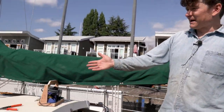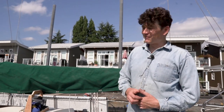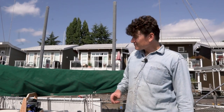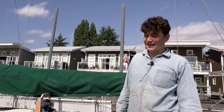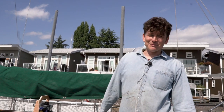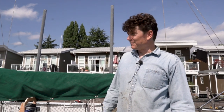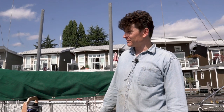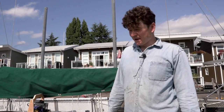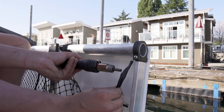One challenge with the side panels is that they hinge in and out, and I didn't want a maze of wires going above deck. So we designed everything around large 1.5-inch diameter tubing to serve as a natural conduit for the cable runs. Running cables inside the tubing of any frame structure is a bit of a nightmare for all the pass-throughs, so we're trying to pull it off neatly before the end of the day. Right now we're wiring each panel with its own wire.